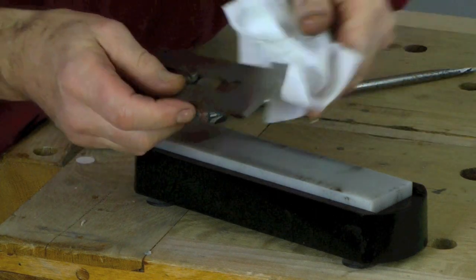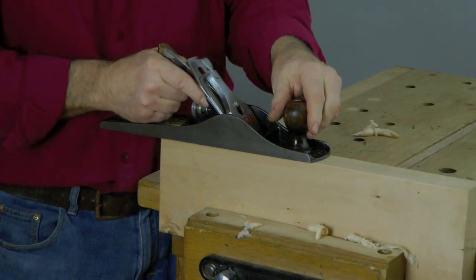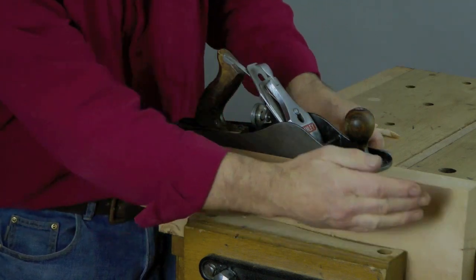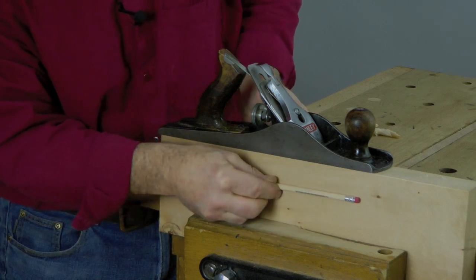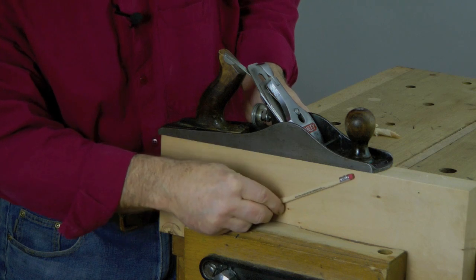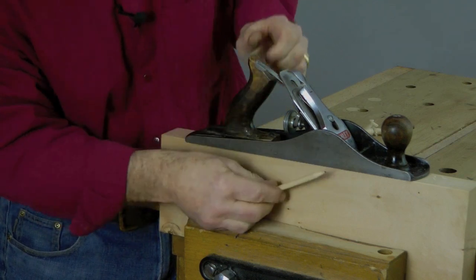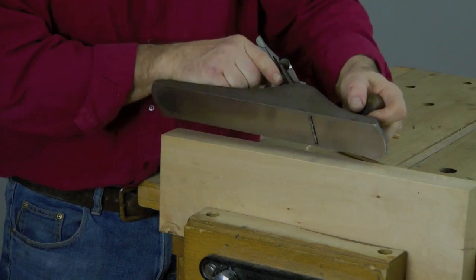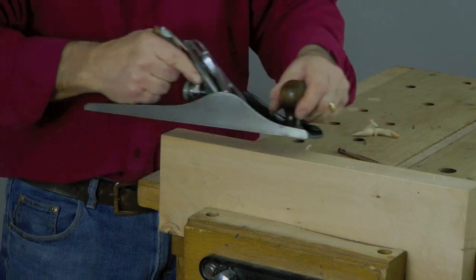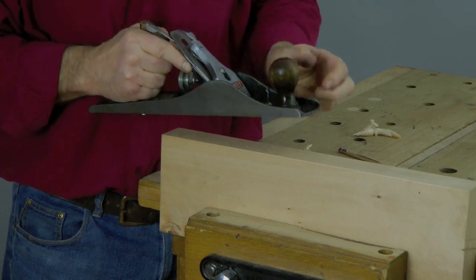Now I'll show you a little bit about how to use this plane. When you're working on an edge where you can see the fibres in the wood — if they're rising or falling to the surface — you want to make sure you're going downhill with the fibres, rather like sharpening a pencil. So check your wood and work with the grain as much as you can. Don't take off too big a shaving at a time; work steadily through finer shavings. It's very tempting to take big cuts, but far better to be patient and take finer ones.